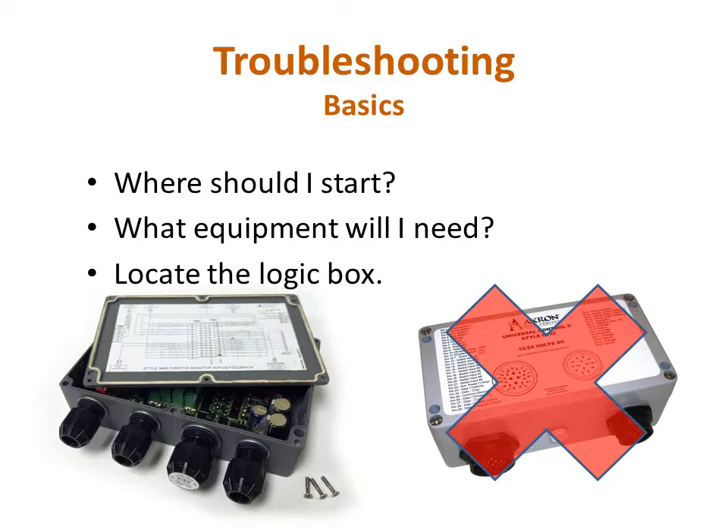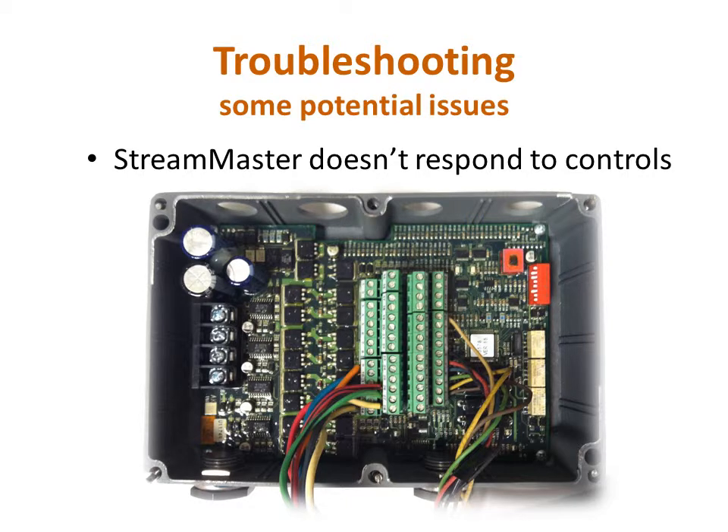In this first example, the monitor does not respond to the controls. If none of the controls are responding, the first thing to check is that power is being supplied to terminal block 2 (TB2), pin 2, and is grounded to pin 3. If there is power to the logic box, then move on to terminal block 1 and check pins 10 and 24, which are the common pins that supply power to any controller wired to them. If those have power and the controller is functioning properly, then the terminal pin assigned to a given function—for instance, TB1 pin 8 for deploy—will get power from the controller when the corresponding switch is pressed. If not, the controller is faulty. If the switch input receives power but the board does not output power to the corresponding motor, then the board itself is bad.